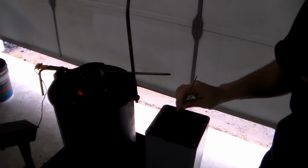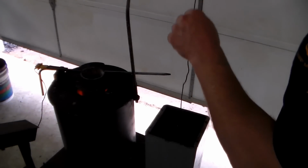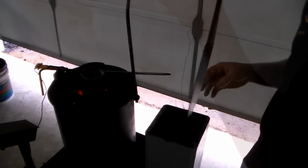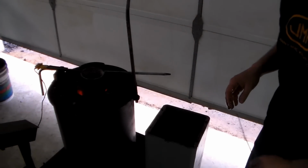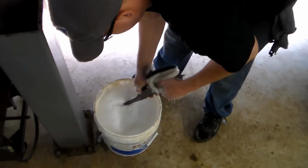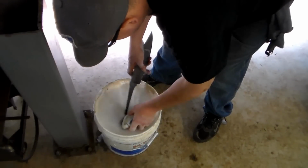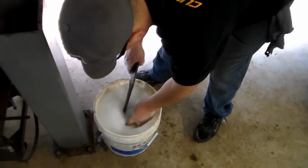And so the very next step is going to be to get the oil cleaned off of this and then get it in a tempering oven. And then I go right into a detergent bucket. Get some of this oil off here before it goes into the tempering phase.